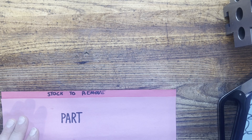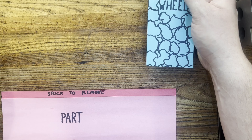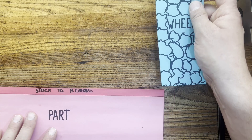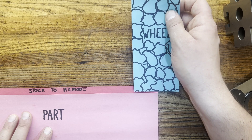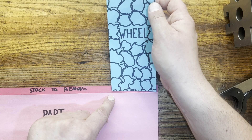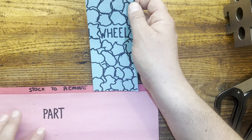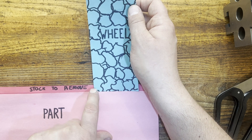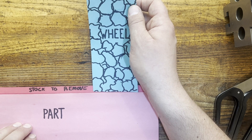In the last video I talked about a process called peel grinding on the manual surface grinder, and a lot of people asked me to do a follow-up and go in more depth, so that's what this video is for. Peel grinding is a technique where we make small step overs as the part is reciprocating and we step the wheel across the part — either going full depth or leaving a tiny bit of spark-out allowance. The distance of that step over is tied to the grain diameter; I never exceed one half of a grain diameter, and in reality I'm usually closer to a quarter or three-eighths of a grain diameter.